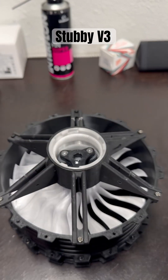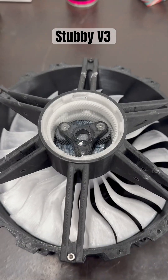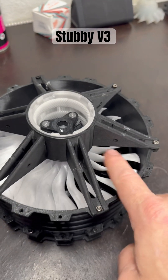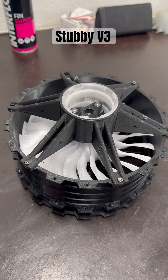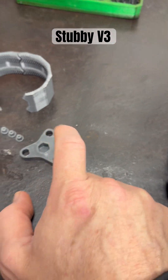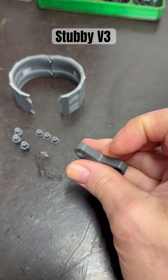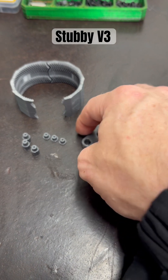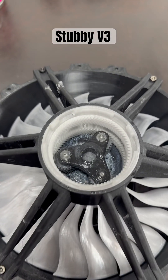Fingers crossed they have schematics in there so I know the bolt alignment, so I can go into Fusion and put those in the mount that I make for this — and then it'll bolt in here just like the older mount did for the other motor. We're going to drive it from the center shaft, and from a cup that fits over the edges of the carrier on each side. So it's not just spinning from the center — it's grabbing it from the outside of the carrier to get more torque. We'll see what happens as soon as that motor gets here.